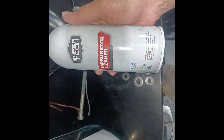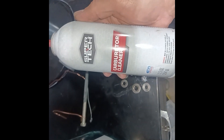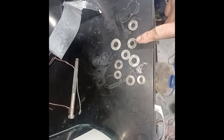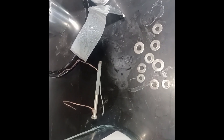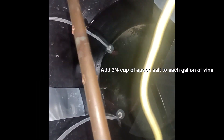This here is strictly just lacquer thinner. When you're using carburetor cleaner — whatever brand you pick — look at the material data sheet and make sure there's no oil or lubricants in it. There are some out there like Gum Out that have lubricants in it; you don't want that. You can clean parts with straight lacquer thinner or brake clean. My solution here is strictly 100% white cooking vinegar — I buy it by the gallon, it's about $3.50 a gallon. It gets some evaporation and I add to it, but it's not much.